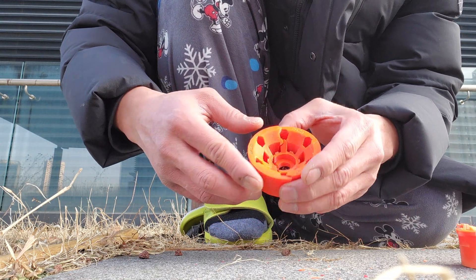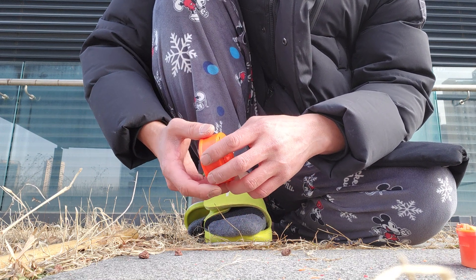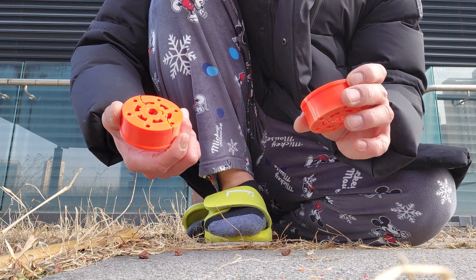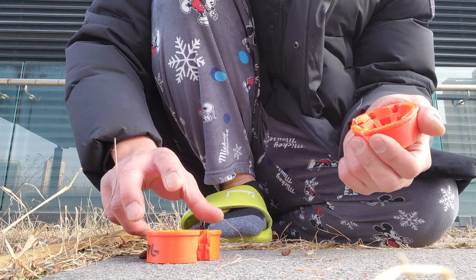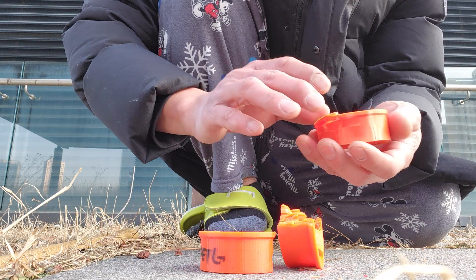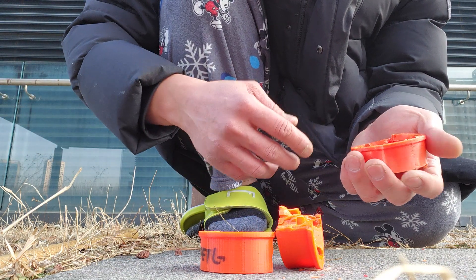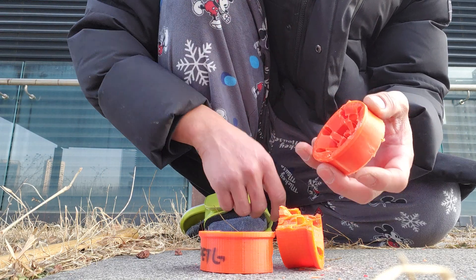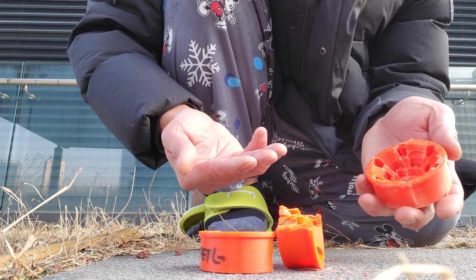As far as looking at these hook tests, I think they're not 100% representative. As you can see here, ABS is a lot more durable for cylindrical objects that must withstand some impact, like skateboarding or something. Definitely ABS is going to be my choice. Of course, UV rays can degrade your ABS, so you may want to use ASA, which is basically ABS that's UV resistant.